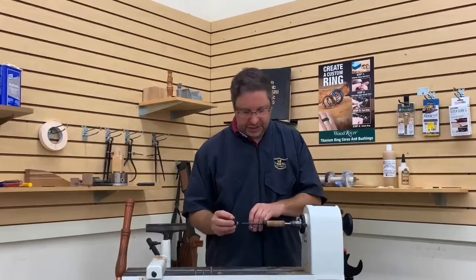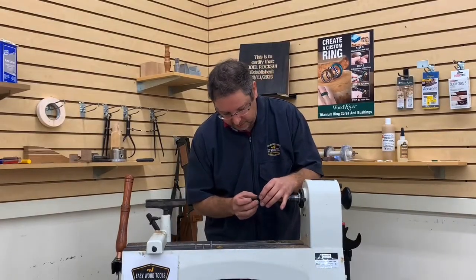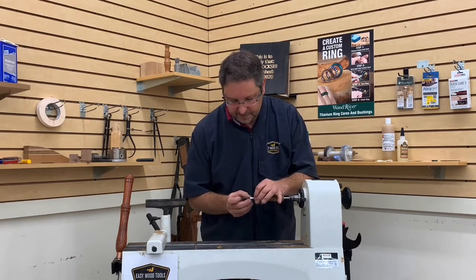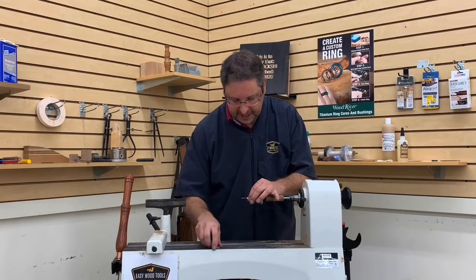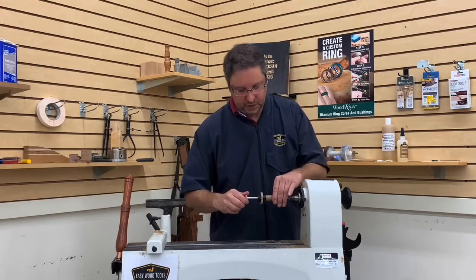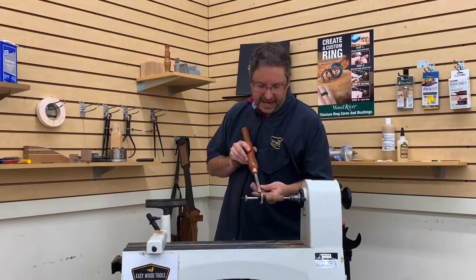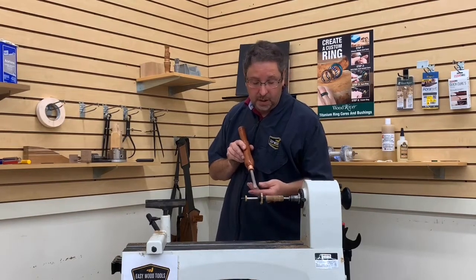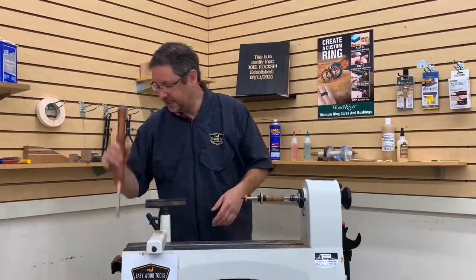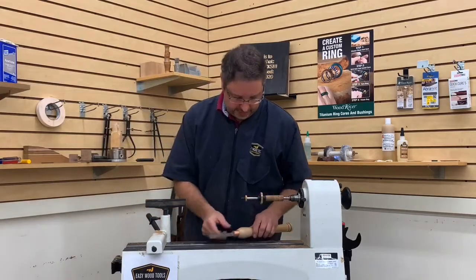So the bushings go. This one got marred up. I'm going to talk to you about that. You saw that I used the rougher, the Easy Wood tools, which I love. If you're going to turn these, I would suggest using a different tool because, as you can see, I've got sharp corners on this tool, and they actually bite into your bushings. So try using a different one. I use the round one, and it works perfect.